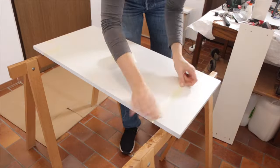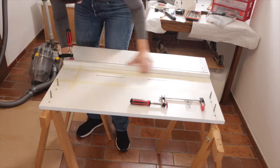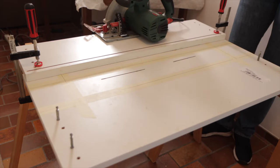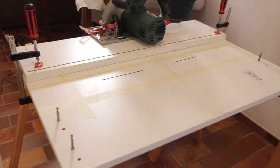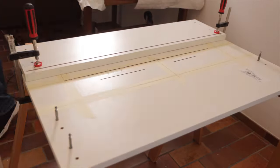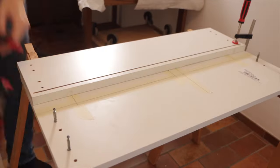This is the very first time that I used a circular saw — it was actually brand new. So after making a couple of trial cuts, I figured out what I needed to do to be able to make a plunge cut. I don't know why I started with something so difficult as my first thing, but here you go. I used the tape method and used the leftover drawer front to work as a guide. This worked really, really well. It was super easy. I don't know why I was so afraid of using a circular saw.